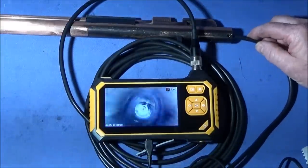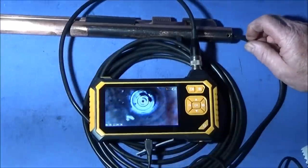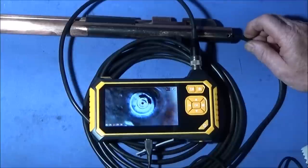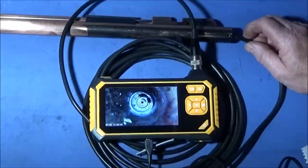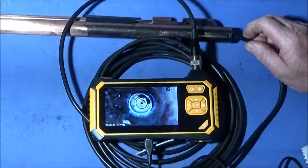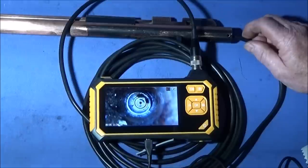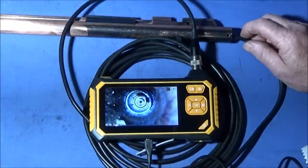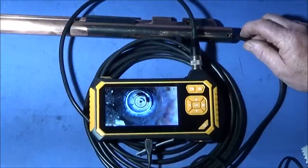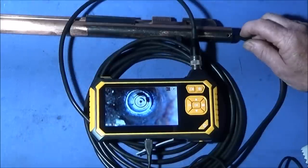And the inlet port there from the pump chamber, you can see there's just a small hole through that one, so there's no way of actually pushing that valve out from that end. Some people say that you can do that with certain pump-up rifles, but you can't with this one because that hole's too small to actually insert a rod or anything to push the valve out from that end, and that's why you need the extractor tool with the thread.